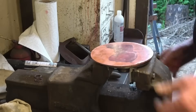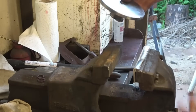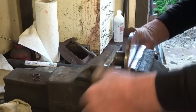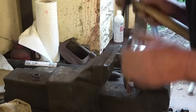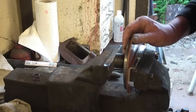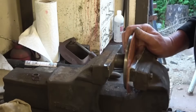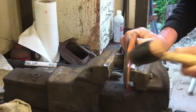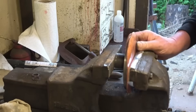These are the copper end plates that were cut and then annealed or softened. The idea is to form these around that edge to make a flange to fit inside the boiler shell. So that is centralised in the vice and we centralise it. We are using the famous eyeball-and-finger method here — and that does look pretty good. The copper is nice and soft, but as you work it round, it work-hardens and then it has to be softened again. I'm not sure how many times I need to heat this and soften it. I'm using the edge side of a hammer just to gently tap it around. You can see how nice and soft the copper is, but it does quickly become more hard.